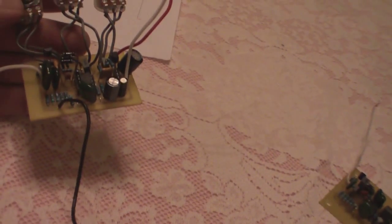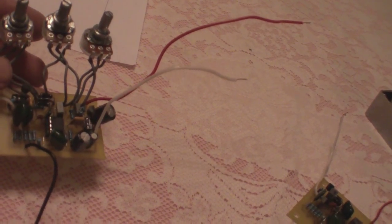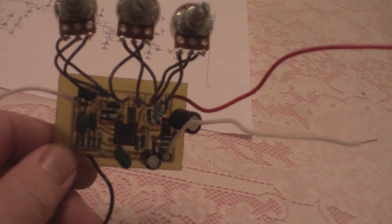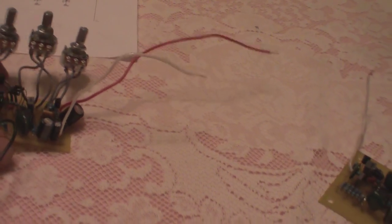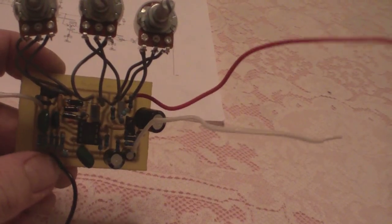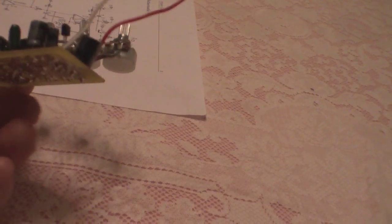And I actually ended up using some different parts on this one. I used a different op amp. It's essentially the same op amp, but it's not a JRC. It's a Motorola, but it should be exactly the same apparently. And the other thing that I did differently on this was, you see those 3 diodes sticking up there? Those are germaniums, 1N34? In any event, those are my clipping diodes for what I think they call soft clipping.